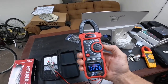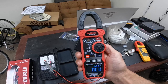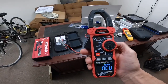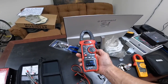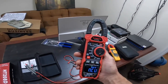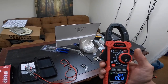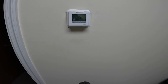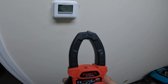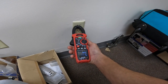I wanted to go over the non-contact voltage. As you see right here, I'm not really close to anything but it's going off — it's reading that monitor right there. If there's voltage close by, sometimes if you're in an active atmosphere, that may be a little bit too sensitive. And here that's picking up 24 volts on a thermostat. And that's a wall outlet.